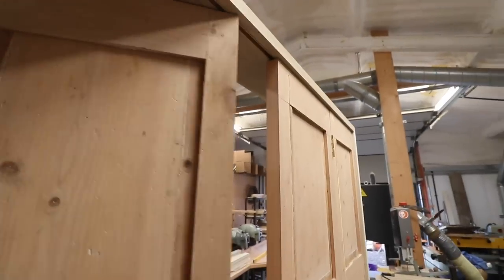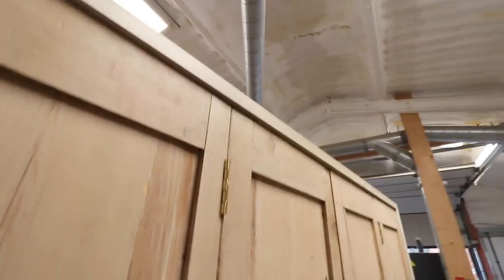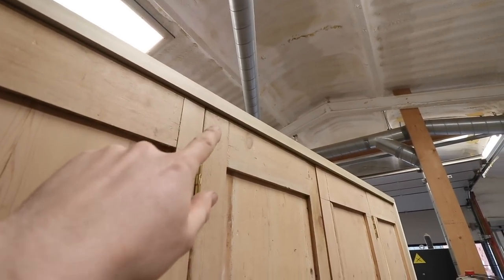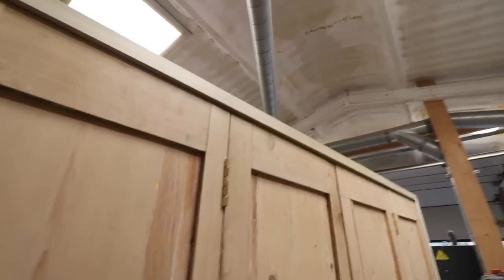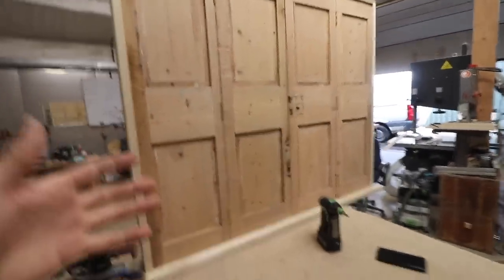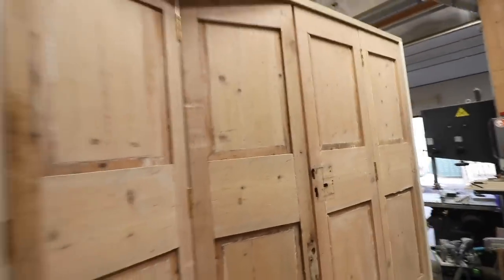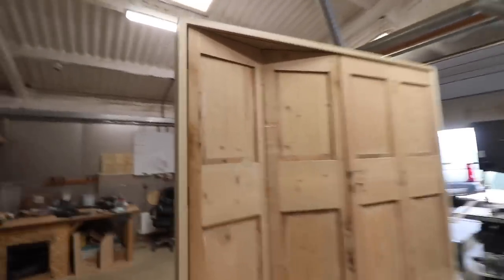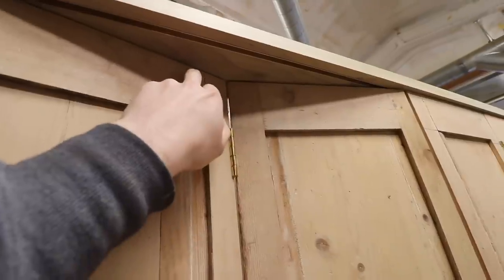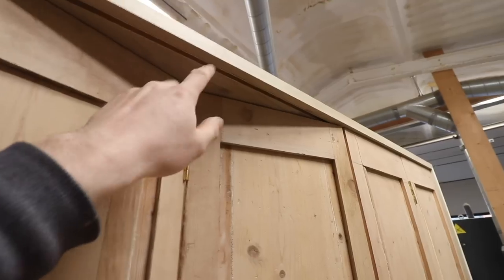What I need to do is add in a door stop at the top, so that when the shutters are in the closed position, like this, I can add in some magnets on this side, and that'll basically allow me to magnetise them shut. So if there's a bit of overpressure in the room from opening a door or a draft comes through, they're not just going to pop open and sit like that, because that'd be pretty annoying. So I'm going to sink some rare earth magnets into the face here, so they act on the face against a stop that's got the same magnets in.